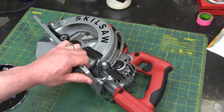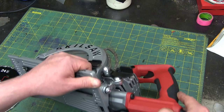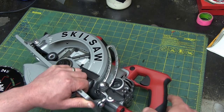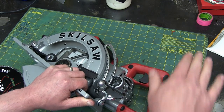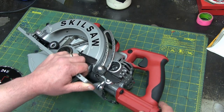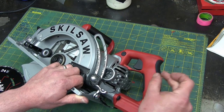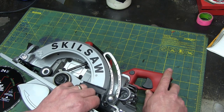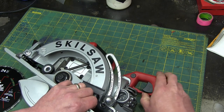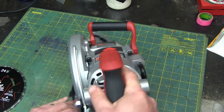There's a marking here — there's a big warp in there. Real thin plastic. This is nylon, but no glass fiber reinforcing — just straight nylon. The glass fiber makes it stiffer and more resistant to abrasion, but it also wears out the mold, so it ends up being more expensive. The over-molding appears to be styrene with butylene molecules on the end. Just a razor-thin trigger guard here on the bottom. That's no good. I'm not real impressed so far with the plastic.